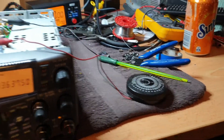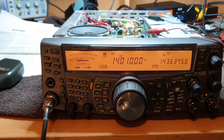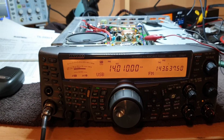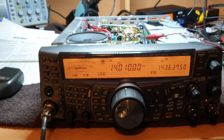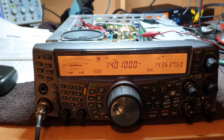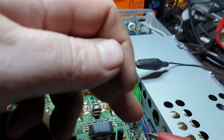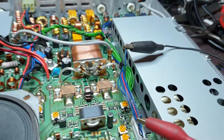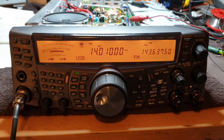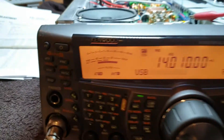You can make a TS-2000 get up to 130-140 watts, I've seen them as high as 150, but they're not going to run like that forever. My advice is once you've got them up to about 110-120 watts, that's where to stop. Then put a fixed resistor in there - a 100K resistor, heat-shrink it in between the connector, and you're set.